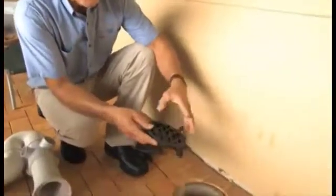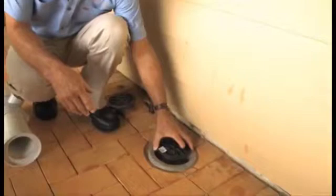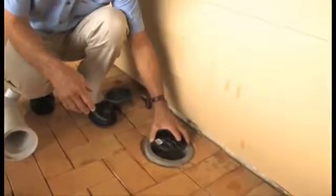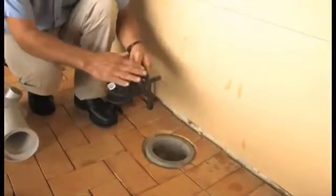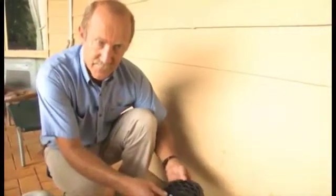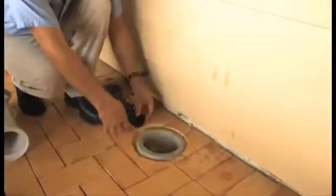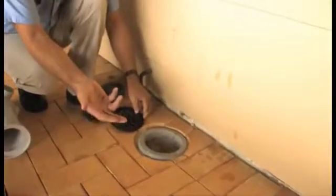Okay, so it's domed, it must be loose, it's not designed to be screwed down or fixed in place. If it is, there's an opportunity for perhaps plastic or paper to cover up that DT grate and stop that effluent coming out. If it is covered up, but it is loose, then it will just simply pop off out of the way and water will continue to flow.